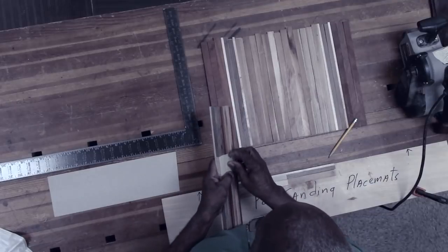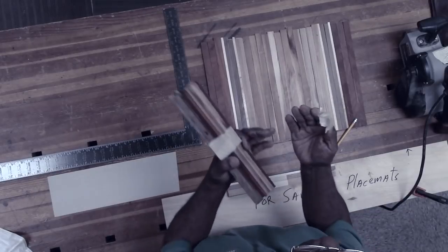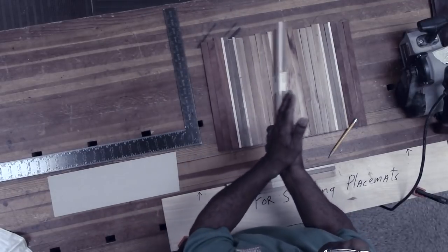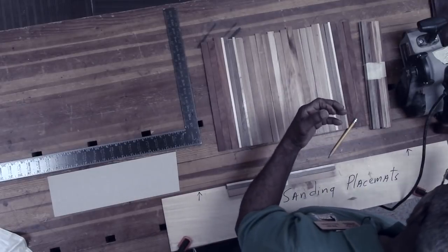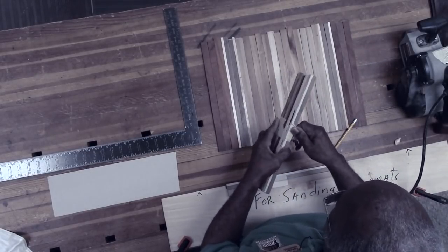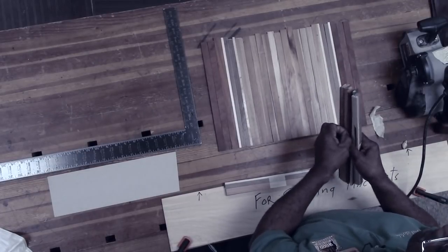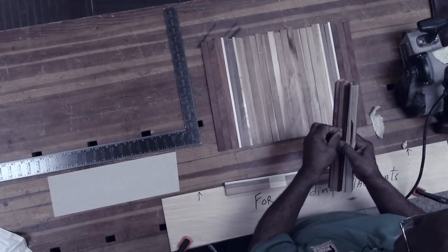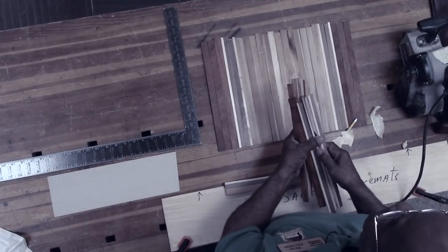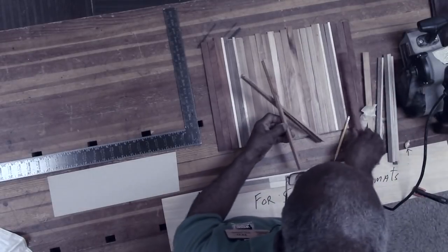When you rip strips, the one thing I do in my placemats is I'm looking at the inside of the wood for the face side. I don't use the wood grain that most people use in furniture and making boxes. The prettiest wood a lot of times is what's inside when you slice it. When you start ripping a lot of wood thin, you can have the best equipment and rip it straight as you can, but the thinner it gets, sometimes the more you'll have curves happen to it. If you don't have some way to straighten them out, you'll wind up with a lot of cracks.